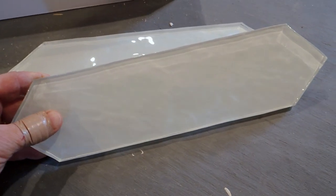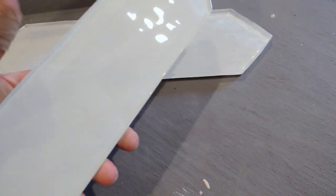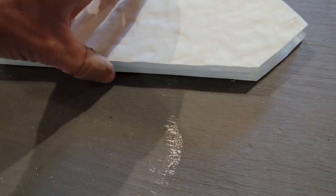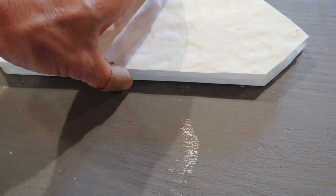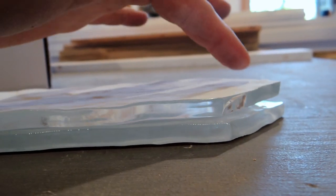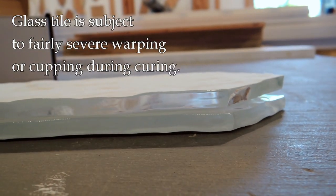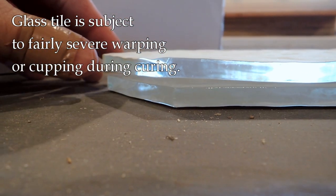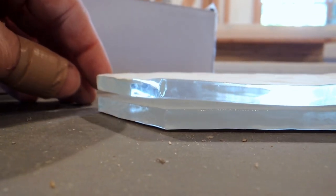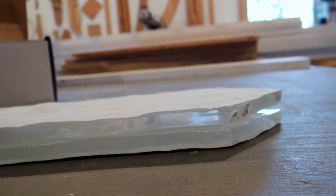Now this may not look like a huge tile, but it's considered large format because glass simply just doesn't get that big. I'm going to put it on top of the face of another tile and get down low here to show you something. These are just sitting in the middle, they're touching. On the end here, look at that gap. That's because as the glass cures, it tends to bend. Very large tile in porcelain or ceramic also does the same thing, maybe not quite as severe. But this is an indication of some of the things you have to look forward to when working with this stuff.